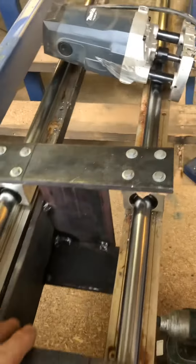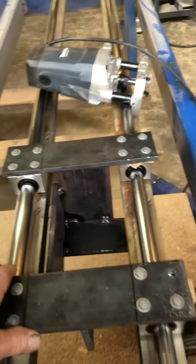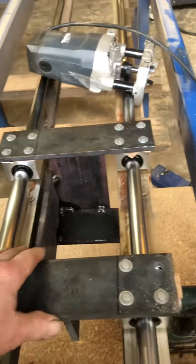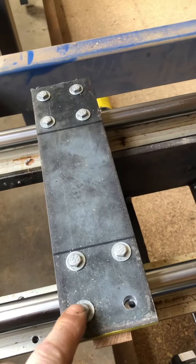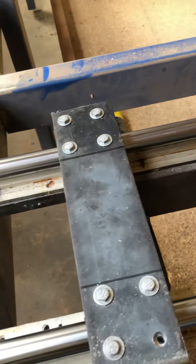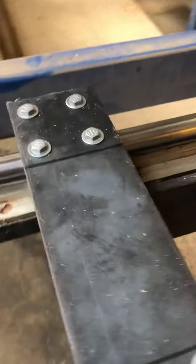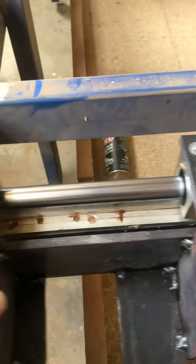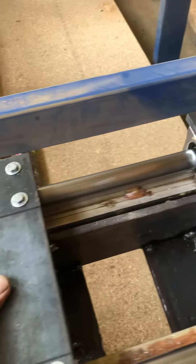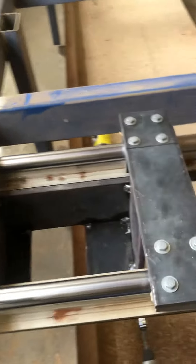What you want is you want it to be obviously free-moving. And that's why I do this bit now, because you can adjust where these go by how you tighten these up. You put your bearing blocks on, put the screws in lightly, and then you adjust it as you tighten them so that it runs freely on your rails. You need a bit of oil and the rails need cleaning up, but I'll do that later.